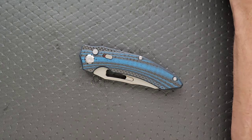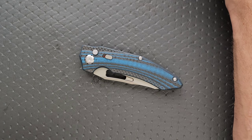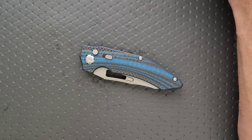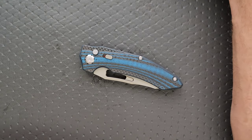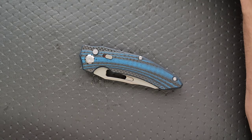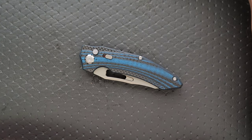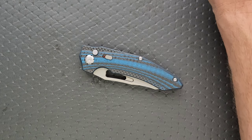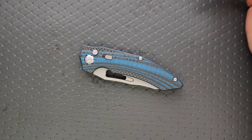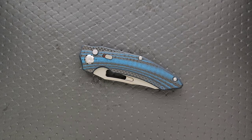You're losing the benefit of the balance of the composition, what the composition is designed to do, which is balance corrosion resistance with really great edge retention. But you don't get that edge retention unless you're hitting at least 60, preferably 61, 62. Anything below that just turns it into a mediocre stainless steel that's got some extra toughness for that specific composition, but pretty mediocre toughness running up against its generally competitive compositions. In other words, it's pointless to heat treat it lower than 60. And even at 60, a lot of people will maintain 60 is too low, and want 61, 62.